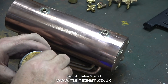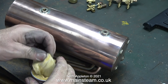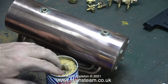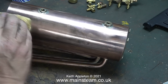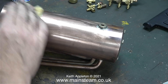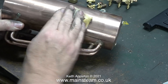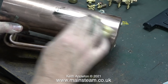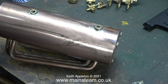I'm pulling off a new, quite large piece of Brasso wadding in an attempt to polish up the boiler as far as I can. There's a bit of messy silver soldering around the bushes but I'm not going to do anything about that — messing about with the fabric of the boiler is not on the agenda. A rigorous polishing is okay, but once I start to use grinders to grind off the silver solder it becomes a problem, and this has already been done on one side by the manufacturer.